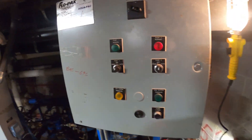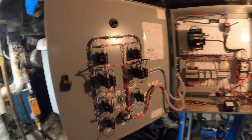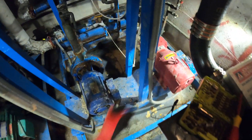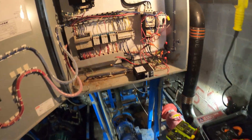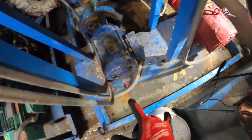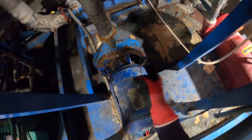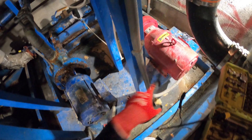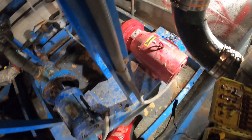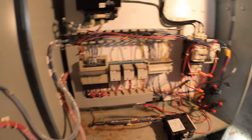Hello everyone and welcome to Jumper Man Tech where we specialize in HVAC but do everything DIY. Today we're working on a domestic water pump from floors 1 to 6. We got a complaint that this motor is burning and smoking. This pump is officially shot — there was water blowing out of the seal and there were some crazy noises. The goal was to get this pump running, but it started to smoke. My suspicion is that this thing is wired wrong.